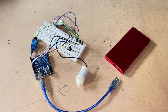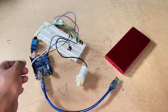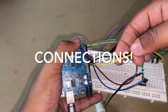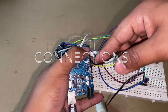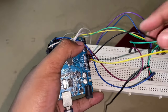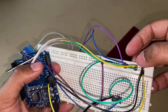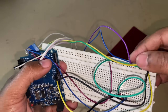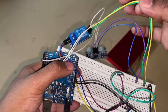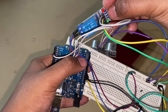So this is the basic setup. Now let me run you through the connections. These two are the 5-volt connection coming from the Arduino — 5 volt and ground right over there — and it is running to the breadboard over here. This is the ground on the outer rail and this is the 5-volt power source. This next goes into the 5-volt and ground connection of the relay.